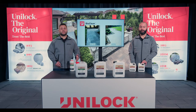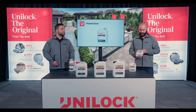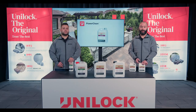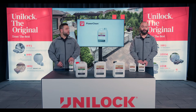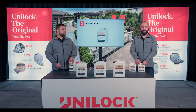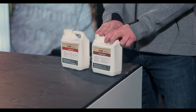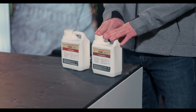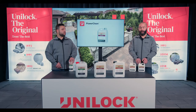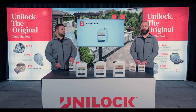Onto the next one: PowerClean. This is another really awesome cleaner. When would you use PowerClean over BioClean? It's an alkaline-based cleaner, which is important — it's good for oil and works as a degreaser. It's really important to use on an acid-sensitive surface, so if you have some light cement contamination on a limestone, this is the product you're going to want to use. It's really important not to use an acid on limestone. It will also remove some food stains similar to BioClean, and they work great in concert with each other.